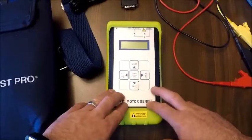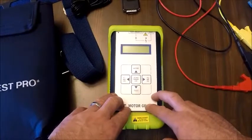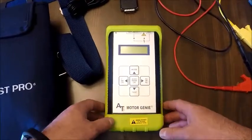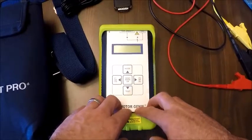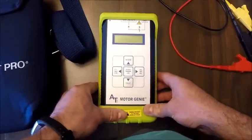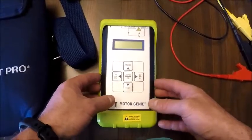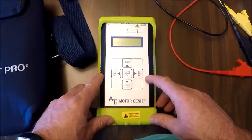What you would typically do on an instrument like this, if you don't have that app, is handwrite a lot of the notes and readings that you take, and then you have to memorize the thresholds or refer back to your quick start guides for what becomes a problem, what kind of deviation from our tolerance is a problem. Whereas on the app, which I'll show later in the video, once you enter all these values, it automatically outputs suggested problems and actions for the readings that you've taken.